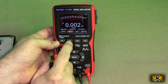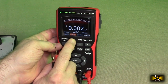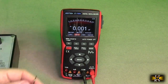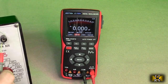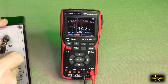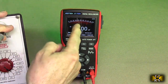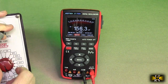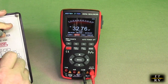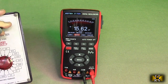On the F2 function, where we had resistance and diode checking, there's a mode also where it'll show you capacitance. That's really handy if you've got capacitors laying around and you don't know what value they are because the printing is missing. You can put it on a given capacitor and it'll give you the actual value right there in real time. It's very accurate, matching what it should be based on this capacitance box.